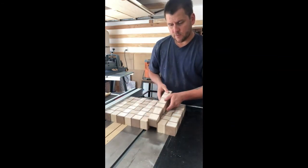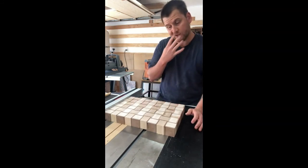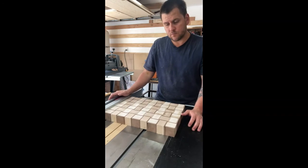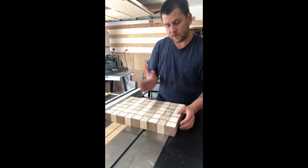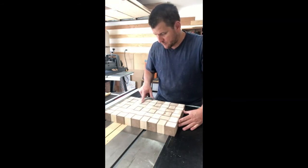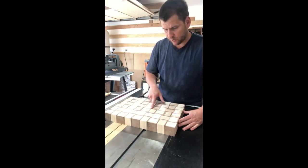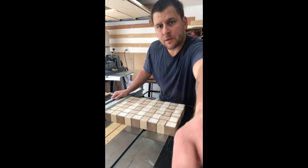So that's what I'm gonna do now, put it in the clamps, check out my gaps. If there's any issues, you might be able to sand them out without it being too noticeable, but again, the more you take off or if you create any dips, you're going to create problems. So it looks pretty tight. I just got a couple cuts that left a little bit of fuzzies, so I'm going to take those off and meet you by the clamps for the last glue up.